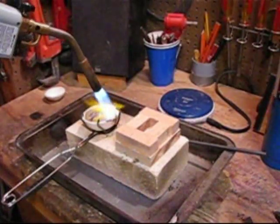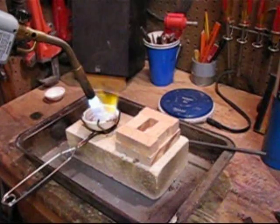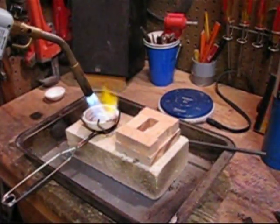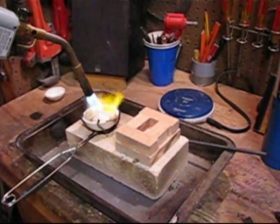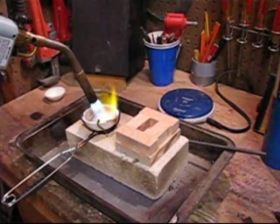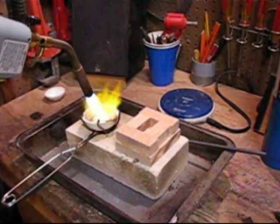Some of the others that I did, I used a different kind of wood — it boiled too much from the moisture in the wood and caused concave bottoms. Some of the others, I heated too much in the crucible and got impurities stuck in the silver.